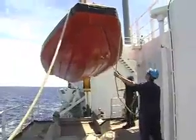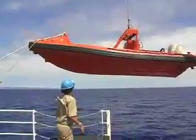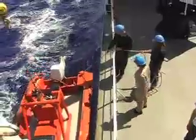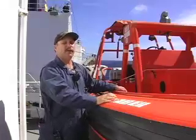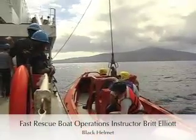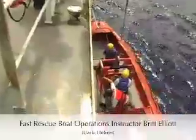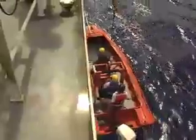We proceed by picking the fast rescue boat vertically straight up, with one person on the bow tending a tag line and one person on the stern tending the line. The crane operator lifts the boat and brings her down to where we can deploy our crew on board. We usually have an officer and two cadets in the boat. The cadet person in charge on deck signals to start by whipping down — the motion is finger down.